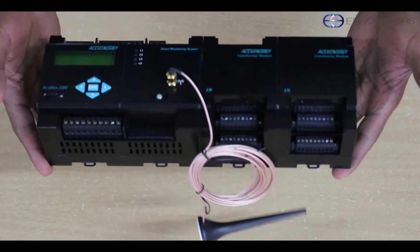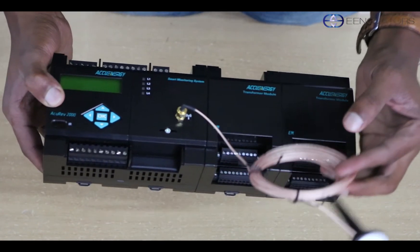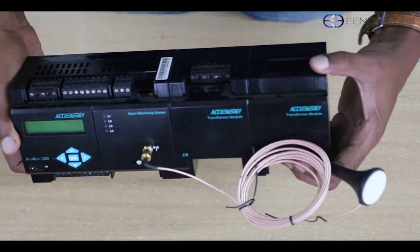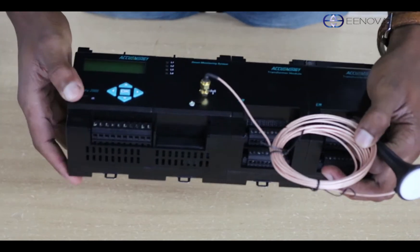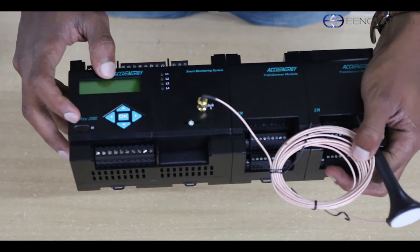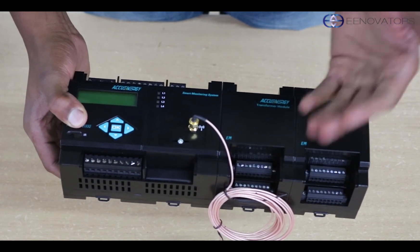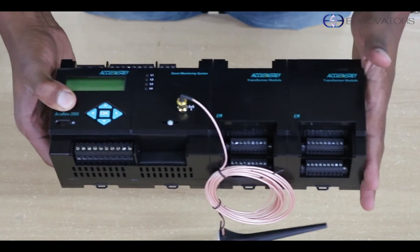That's something else that comes with the meter — there's an accessible portal for you to configure the meter and view all your data. There is also a provision for your current transformers. Finally, there's a provision for infrared readout, so if you need to know the values produced by each circuit being monitored, you can use infrared communication to read out whatever the meter has recorded.